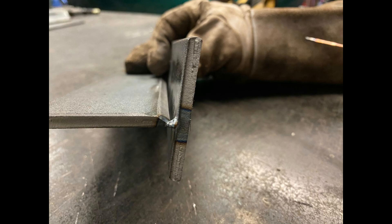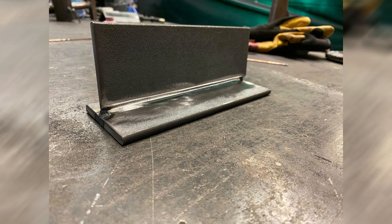Welcome back everybody. We're going to do something slightly different — a single bevel with an open root. We've got a 2.4 millimeter gap using 130 amp DC negative. For the first run, let's get that root in. We're looking for penetration out the back side. Notice our tungsten is sticking out a little further than usual so we can get right into the bottom of that joint.